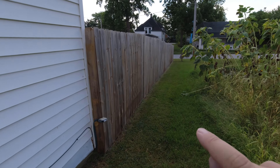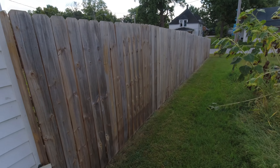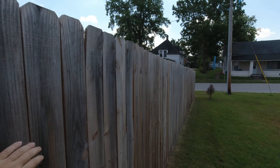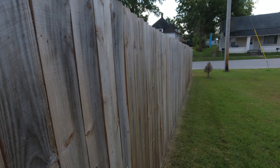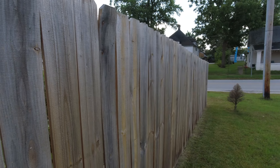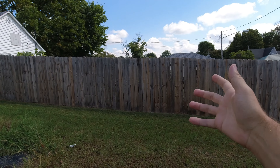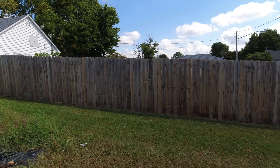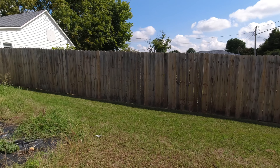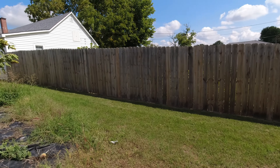This is actually the first part of the fence that I built, so I made more of my mistakes on this end. The other end that you saw first is actually where I ended and I had improved by that point. But putting up that super green wood just meant that a lot of it was going to warp and cup and do all sorts of things when it dried, which made all these problems I have to fix. I've already replaced a bunch of the pickets, but these pickets were literally just cupping and warping off of the fence. So dry your wood out if at all possible. These were AC2 pressure treated green pickets and they are a lot greener and wetter than they should be according to standards from even a few years ago — those standards are no longer being met.